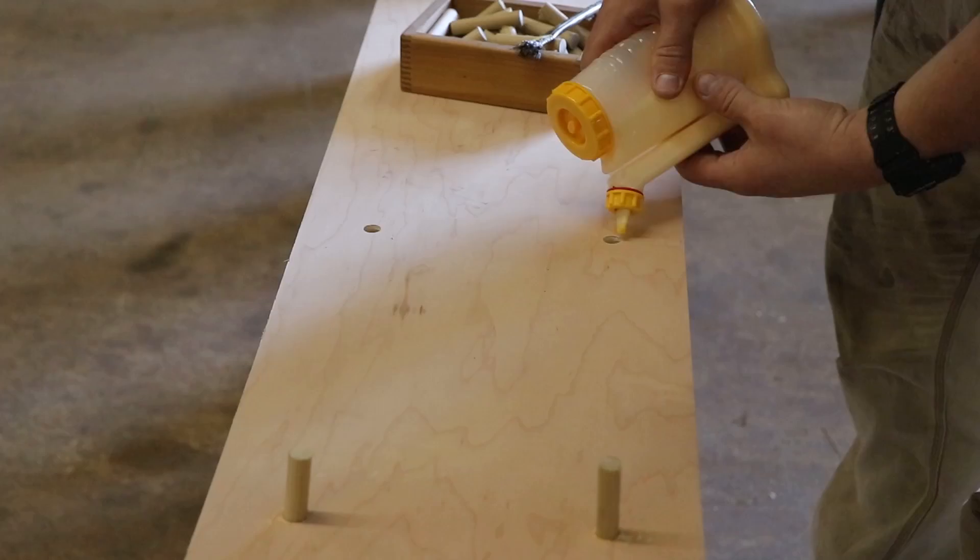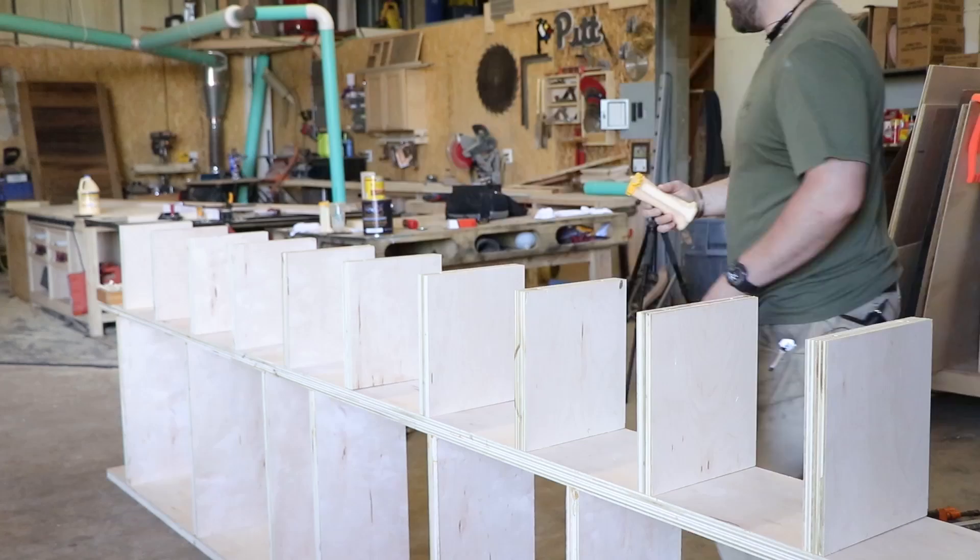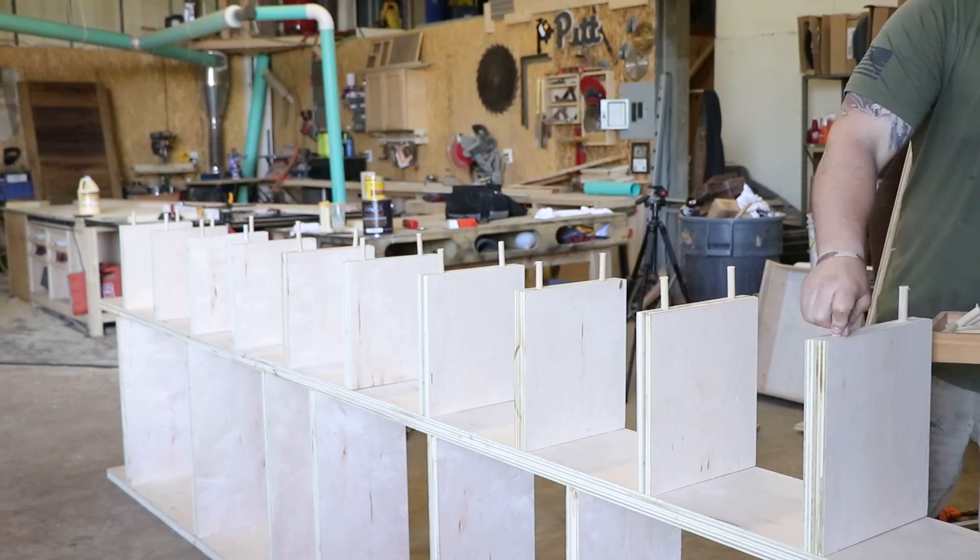For this joinery I just use my dowels that I cut by hand, plenty of glue and a brush. I put wood glue on each side of the shelf as well, and I just hammer them down in with some clamps — that holds up very sturdy.